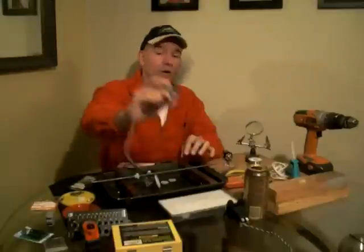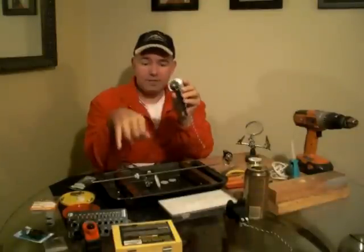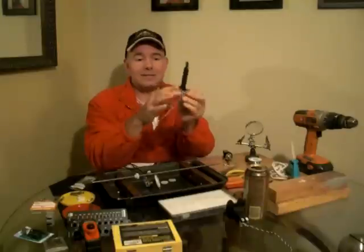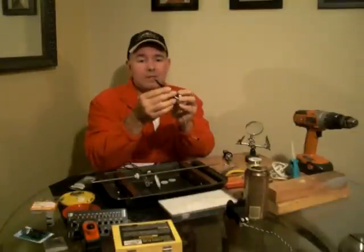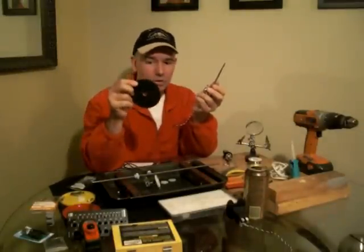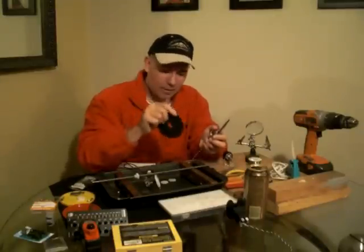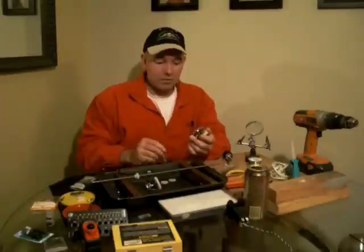At the same time I'm going to glue up my speed brake lever. I purchased a 100K linear potentiometer — that's what you want for both of these; they're called 100K linear, very important. This speed brake lever actuates the rod coming out of the potentiometer. I made it out of .100 stock 6061 aluminum. You could use wood or other metal. I had to cut it out using my 4-inch grinder — again, a dangerous tool, available at Home Depot for 30-40 bucks or cheaper at Harbor Freight for under 20. Use a fresh blade so it cuts smooth, and cut slowly so it doesn't kick back.